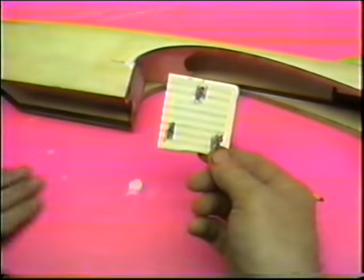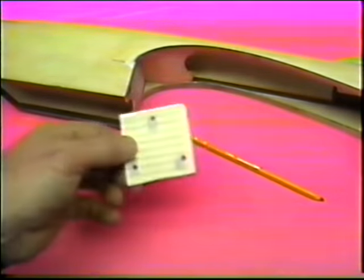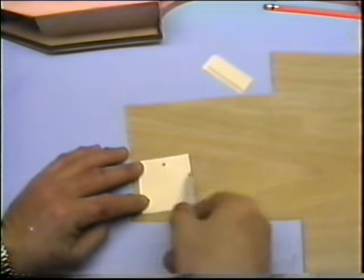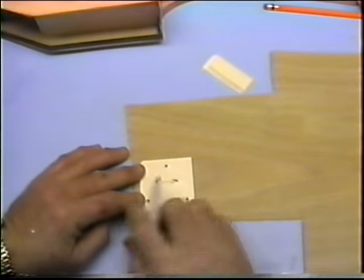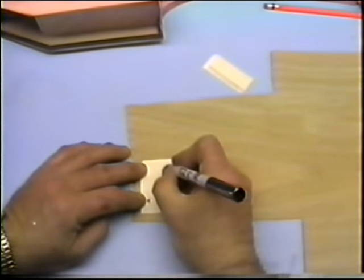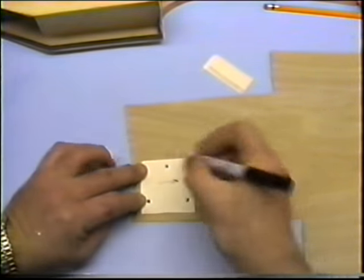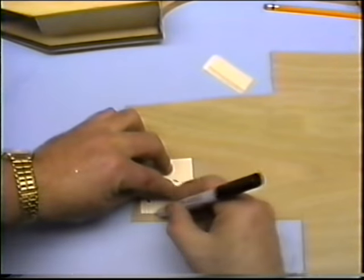Now I want to make this piece out of a piece of plywood and make sure it bolts right to the back there. Because all of the torque reaction is going to be in this dimension, I want the most amount of grain that I can get going in this dimension. But I can just drill the holes first, see that I have a good alignment before I make up a part. And this, I don't even need the hole. I can figure this out after.